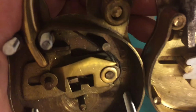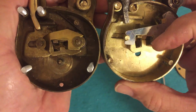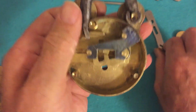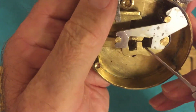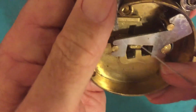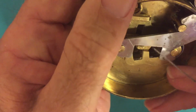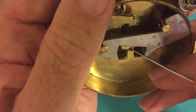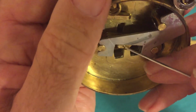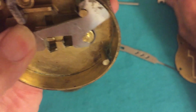Now if you look at them side by side, look at the shape of the levers. The Squire, I'll show you the gate here. It's a 0 cut gate, and it doesn't have a stop up here that stops the bolt from traveling. The second one, I guess the number 1 or 2 through 4, has this long stop. It's usually twice its thickness, maybe 2.5 times the thickness of this bolt that slides across, so that the lock has to be lifted to clear.